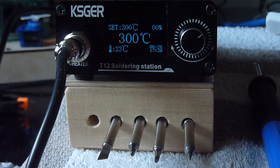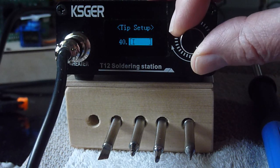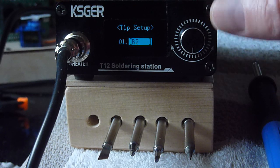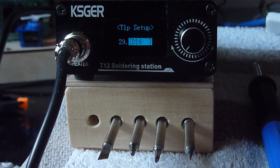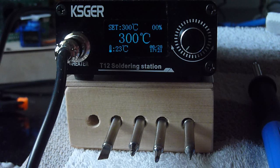The unit uses a PID temperature regulator. There are different kinds of tips with different kinds of temperature behavior, and therefore there are different parameters available for every tip type. So it's a good thing to first select the tip type that you're currently using. To do that, press the button and rotate to the right, and then you can scroll through a short list. That short list is edited in the menu and now contains only the tips that I own — otherwise I would have to scroll through over 50 different types. The tip in use right now is the D16. I selected that and pressed the button, and now it uses the perfect parameter set for this specific tip, leading to the highest possible accuracy and stability.